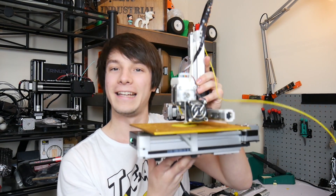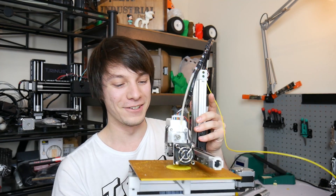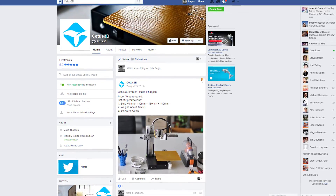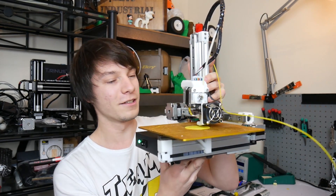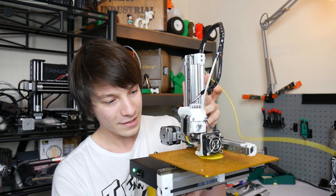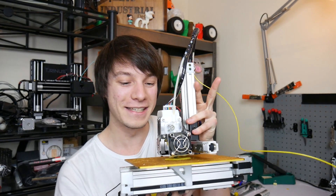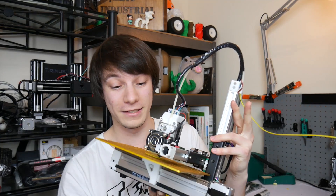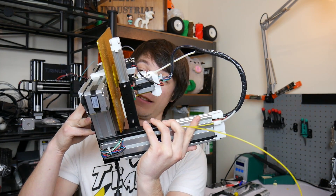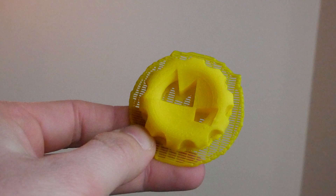You might be wondering about the Toner Plastics PLA — it's currently printing in a machine on the floor. This is the Cetus — I can't tell you much more about it, under orders from the manufacturer, but it's going to be a crowdfunded 3D printer very shortly. It's a completely open frame design with linear rails, PLA-only, no heated bed needed, with a special proprietary coating on the bed. It is printing with a raft, and it's running pretty well — a robust little low-cost machine.